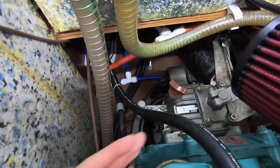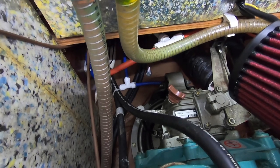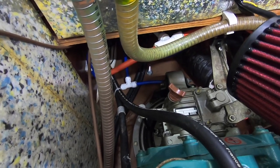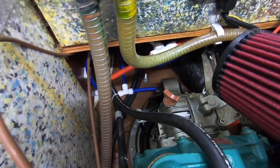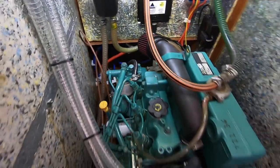I'm going to warm the engine up. It's not going to make any difference to extracting the oil out of the sail drive itself, because that will not warm up - we're not going to generate enough heat in there to help us. So it is going to be quite a slow process in terms of extracting it, but we'll just leave it for a bit and see how much oil we get out. I'm going to do the engine oil first and then I'll come back and do that one.